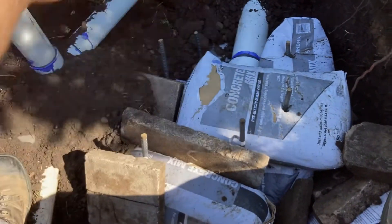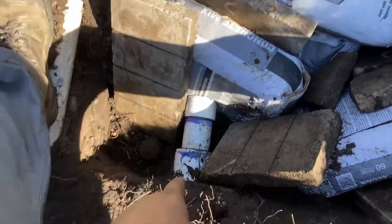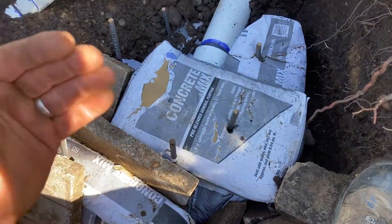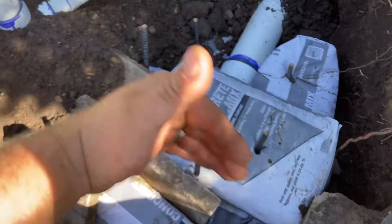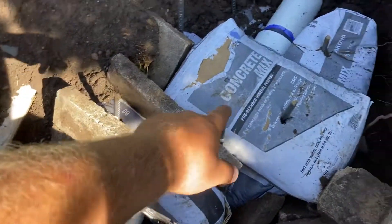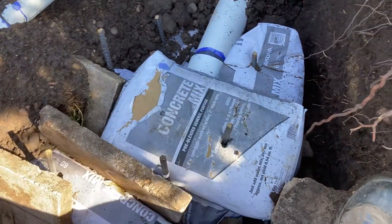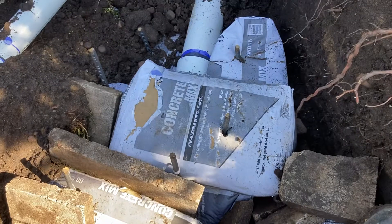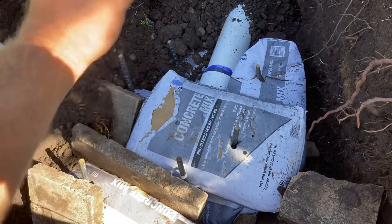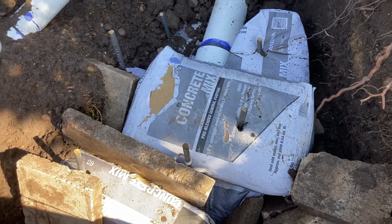This is an elbow — I don't want it to come off this way because it reduces down here. I got the cap and the cap is just doing double duty. I got a bunch of concrete; I like to stack my bags so they'll stagger. I'm using rebar that's pounded through to tie the bags together. They had a bunch of blocks just behind. For extra bonus points, you can put a loop of rebar in the concrete so you can pick up the bags later if you ever have to do a repair.